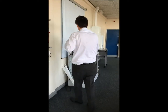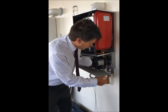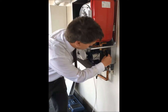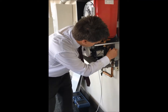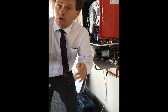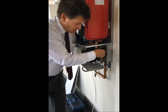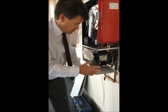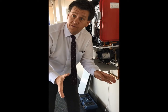Just back across to this pre-mix appliance. What we've got here is the low water pressure cutoff switch, and here we've got the flow switch, or the pump proving switch, or the differential switch. It links back around the return. This works like an old Giannone-type diverter valve — you've got the diaphragm, then you've got the micro switch. This links through the low water pressure cutoff switch. So basically if the pump's not running, then the pump proving switch will not energise, and consequently the boiler won't fire.